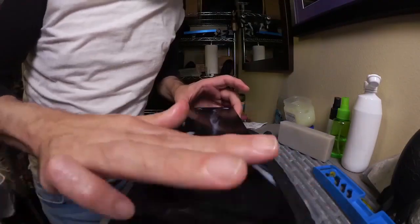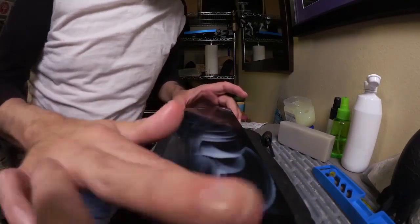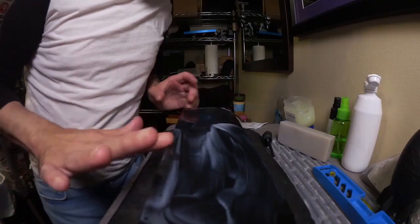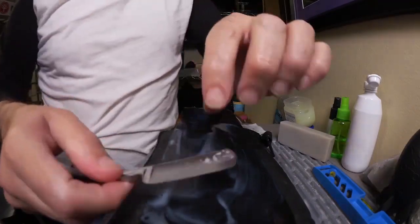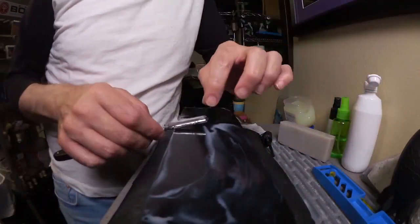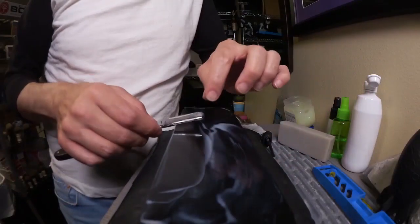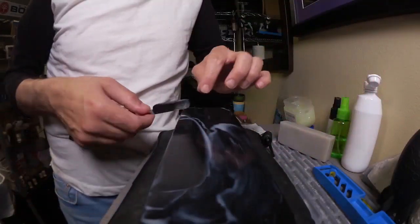bending but not breaking. I'm going to do a little bit more of that, and then I just finish by going a few strokes toward the cutting edge again at 90 degrees. Just to make sure if we built up a little bit of a wire edge that we didn't leave it behind. Although, to be honest, I would imagine the stropping wipes that right off.